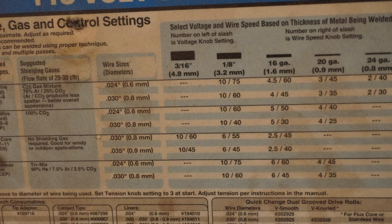With outside corner joints you have to run way colder than any other joint that you weld. If you follow the chart in your welder or the recommended settings for that material thickness, it will absolutely kill the aesthetic appearance of your weld. Yeah, it'll be a weld that holds your metal together perfectly fine with a lot of penetration, but you're never going to reach that aesthetic appearance you're looking for.